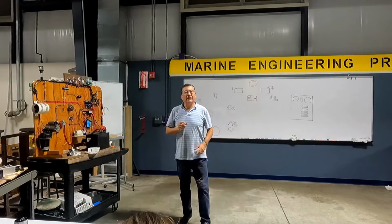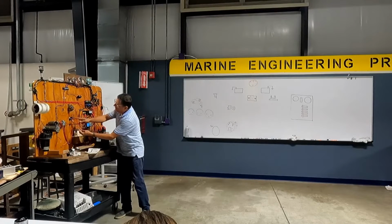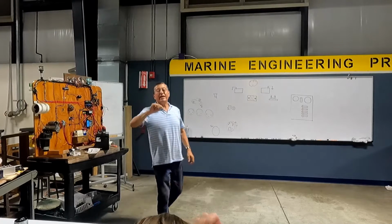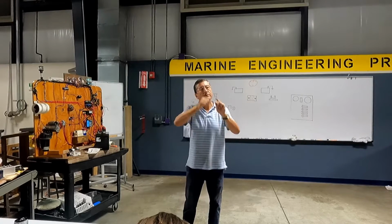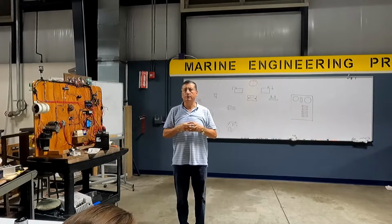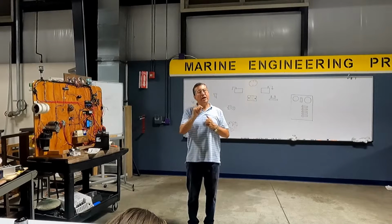There are bilge pumps that, if you see this one, in the pump only have positive and negative, and the positive is coming from, you see? Okay. But there are pumps like this with 3 cables, 1 negative and 2 positives. 1 positive is brown, and the other positive is brown with yellow strip or white strip. Pay attention. The pump has 3 cables. 1 is negative and 2 positives. 1 is brown and the other one brown with a white strip.